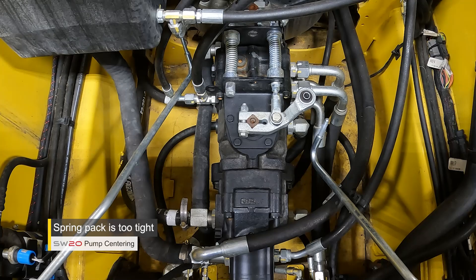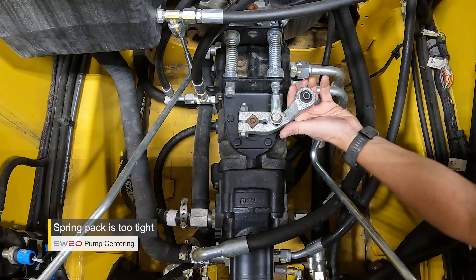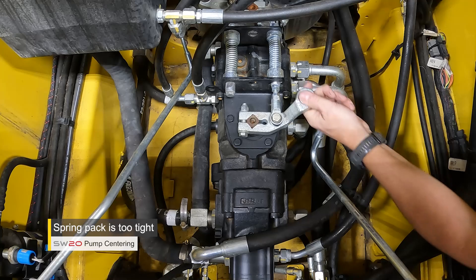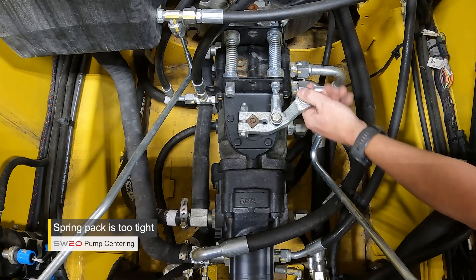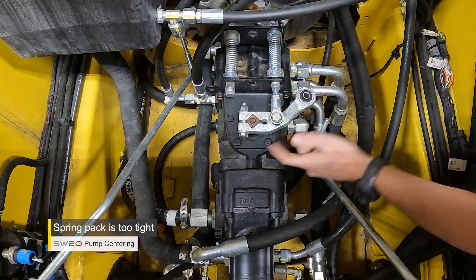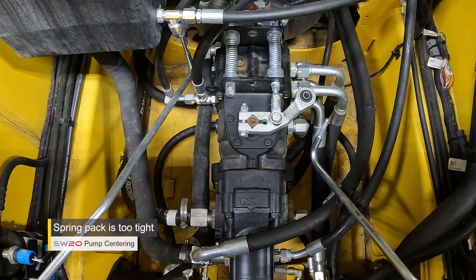You may observe a loud pump when you first start it up. You may also observe the engine might struggle to start because the pump is actually trying to move when you're not commanding the movement. With the spring pack not adjusted, you can see there is play in the spring pack between the brackets. You can also observe the pump rapidly moving when you're trying to start the engine — I could demonstrate that by starting the engine. We should see some chatter out of the pump since the spring pack is out of adjustment.